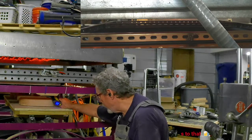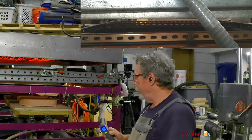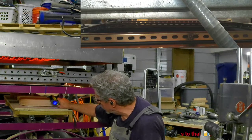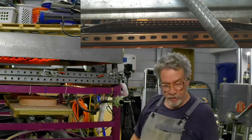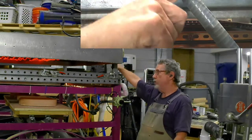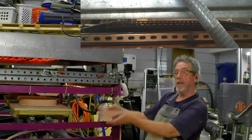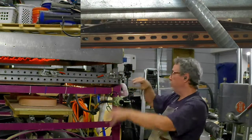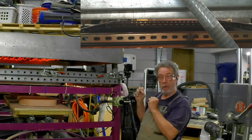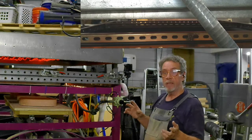We're going to make a part in just about another 2 or 3 minutes here. 2:23, it's getting close to happening. And when it does, I'll go through the little process over here going down the line. The way it works is this, just so I let you know what I'm going to do. I'm going to turn off the heater, pull the heater back off the top, come around here and turn this valve and make the mold go up and stretch the plastic. Once it stretches the plastic, then I'm going to turn this valve, and that's going to make the vacuum that sucks it down onto the mold. And if everything works well, that's what happens. And if not, you get the hearse back, say bad words.